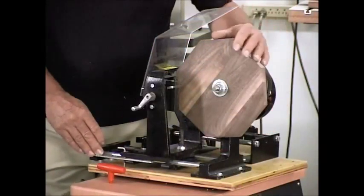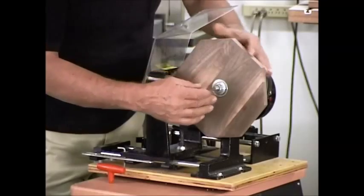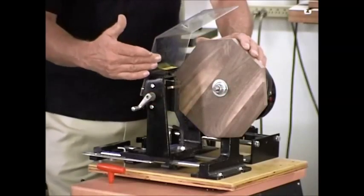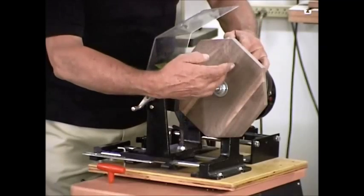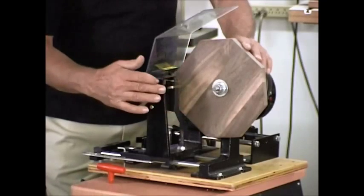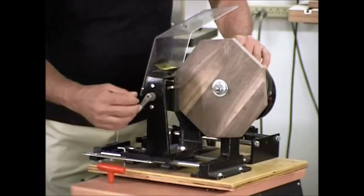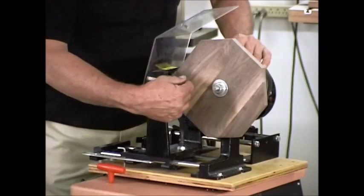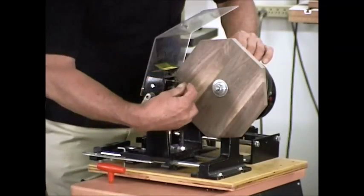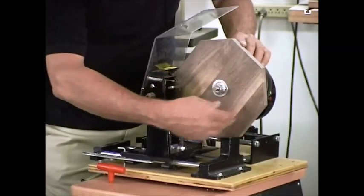When you're working with an octagonal shape or any other shape other than straight round, it's a little more difficult — the hole must be absolutely centered so that it's going to be attractive however you cut it. Now we can do one of two things: we can cut all the way through and separate the outer ring, then take that to a router table and cut a rabbet in the back and round over our edges. Or the machine itself can be used to nibble away the recess on the inside to hold the glass, the photo, the mat, or whatever we're going to put in.